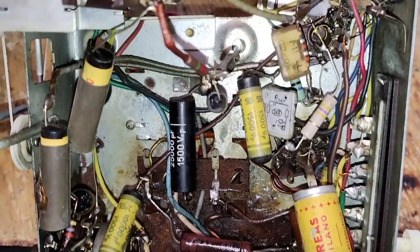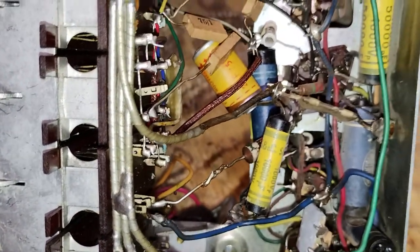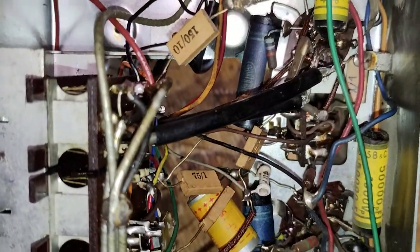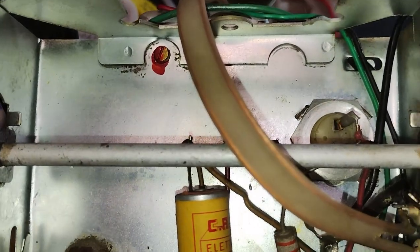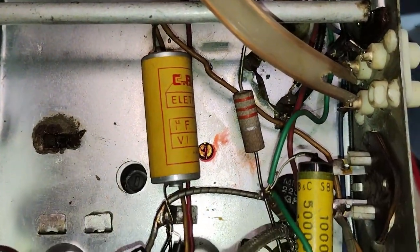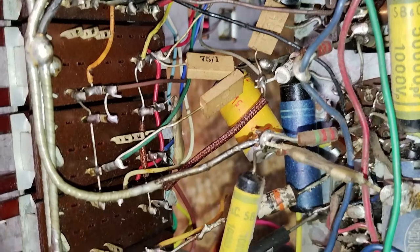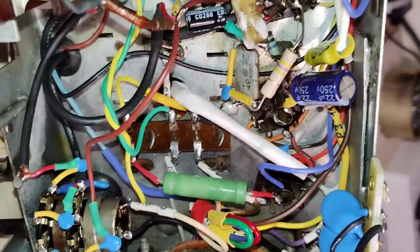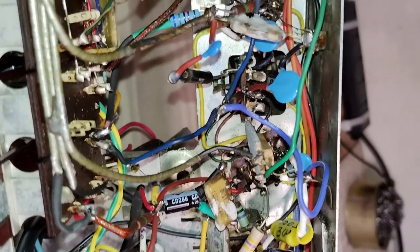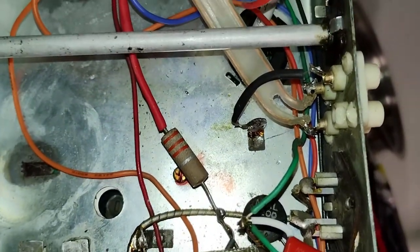This clip shows the condition of the radio under the chassis after some cleaning, but before the electrical restoration. It should be observed that the design implied to connect components on the fly without dedicated posts. Because there were different layers of components, while replacing the paper capacitors, small ceramic equivalents have been chosen when available to gain space and make it easier to proceed with the electrical restoration.